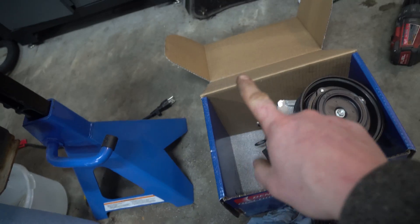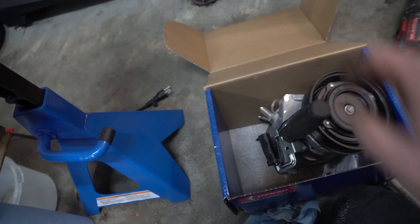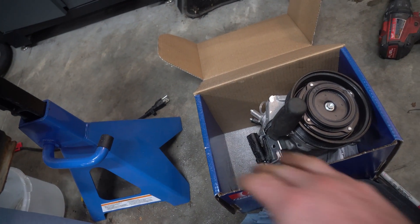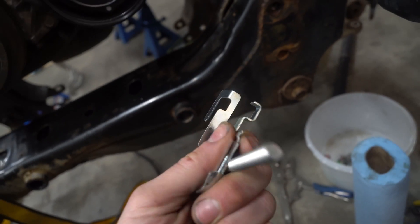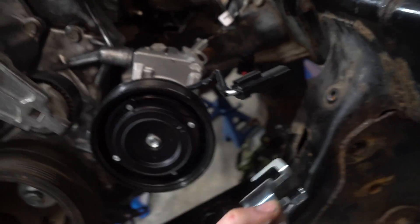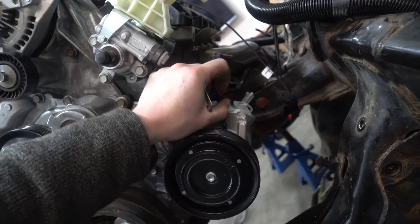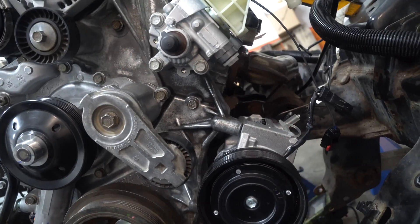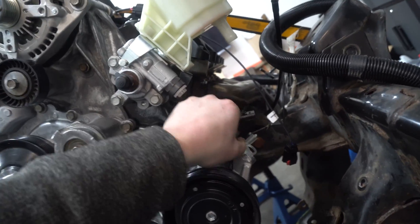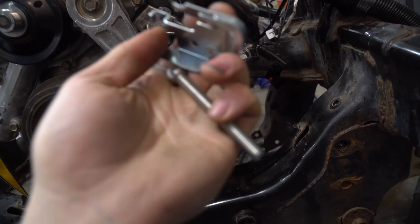From there, completely vacuum the entire compressor - as you can see we've still got these ports plugged, which you should always have plugged anyway. Vacuum it all up so we don't have any of that debris transferred onto the engine. See this right here - pull up and slide that off. You're probably going to end up zap-strapping or keeping this away from the pulley. You don't want that clip accidentally getting caught in the pulley, so make sure it's over here and out of the way.